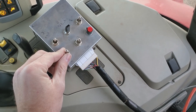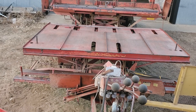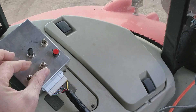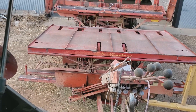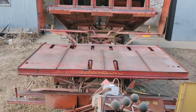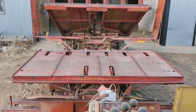This is the switch for the auto tie feature — we'll try to get this to do its thing. Now we'll move the push-off feeder all the way in. You can kind of see them starting to go out. When it squeals like that, that's how you know the draw is all the way to the end of its reach. I can stop it, make it go, make it creep along by just turning this dial real slowly — see, there it's going real slow.